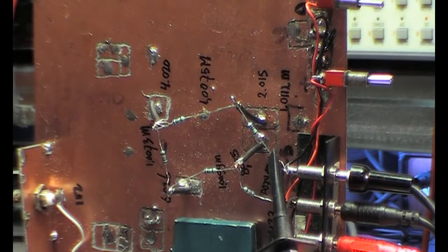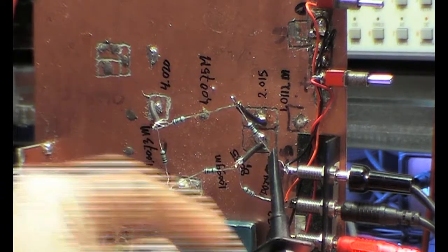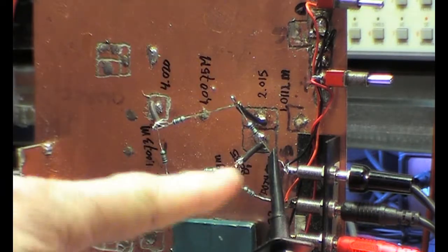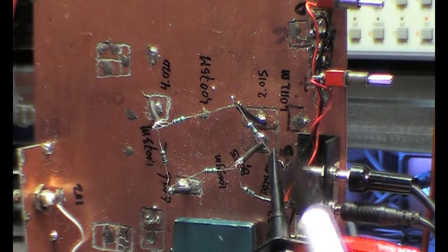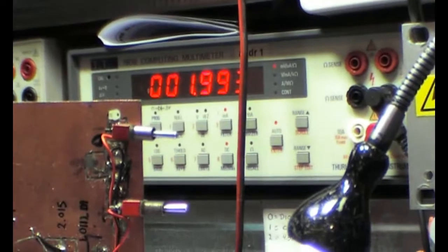So this high-tech piece of engineering I made is the thing we're going to use today. These are the 5 resistors. There is a multimeter hanging over them at the moment, so they're hanging over a very high impedance, but that is not really the case, because it is parallel to the source and the source has a low impedance. So it is no problem to measure the output voltage of the VREF. You see 4 connectors here, but that is because one of them is measuring the current, so you can show what is happening, and that will be done by that meter there.